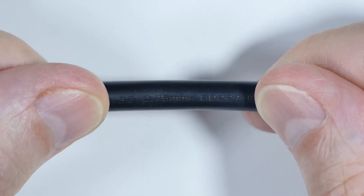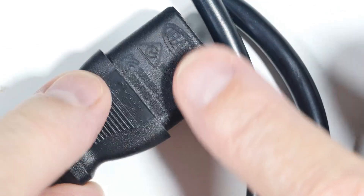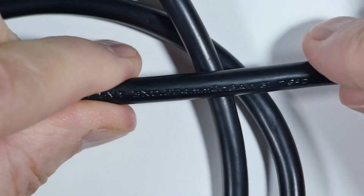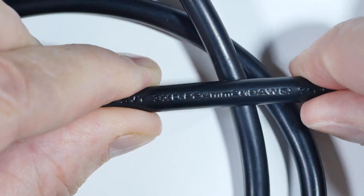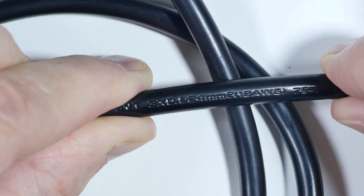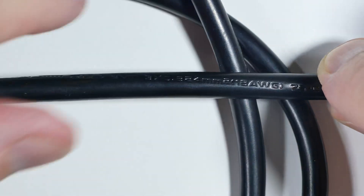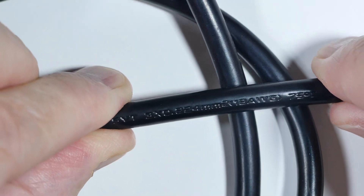The next candidate out of my spare plug box says it's rated at 10 amps at 125 volts, so it appears to have been made specifically for the American market. The wire marking reads 3 × 0.824mm², or 18 AWG. However, information I find online says this is about 7 amps continuous at standard temperatures, so I'm not sure why the plug is marked at 10 amps — that's the conflicting information I mentioned.